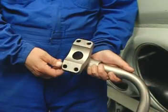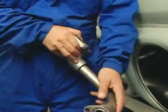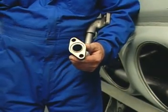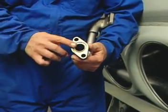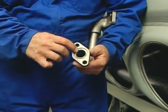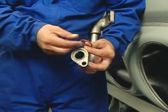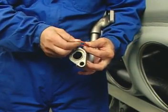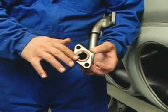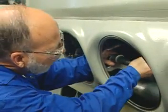Next, the water inlet tube can be installed. Removing the tube from the designated container or basket, check to ensure that the seal groove and saddle clamp surfaces are clean and free from any nicks or burrs to prevent possible water leaks. Obtain a new water manifold saddle clamp gasket and liner-to-tube seal from the gasket kit that was shipped with the new unit power assembly. Apply the seal to the water inlet tube after applying a light coat of Dow 4 silicone grease or the equivalent.